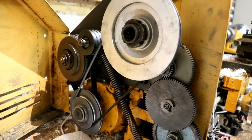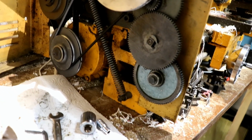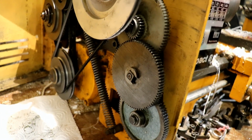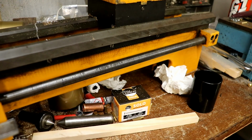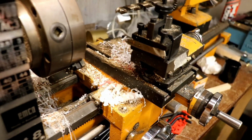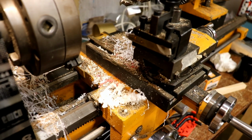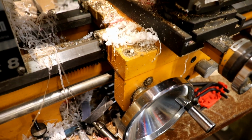After much fiddling around at the dirty end of the lathe, well, I say dirt, it's just lots of grease and lubrication, I think I have figured out, probably wrongly, but I don't really care about the measurements, how to set these three gears to turn the lead screw. Come along here, this is the lead screw that runs along the front of the lathe, and that turns and can, if you wish, move the carriage along. And I want to make these grooves a spiral groove around this little bit of plastic, so I need this lead screw to go relatively fast.